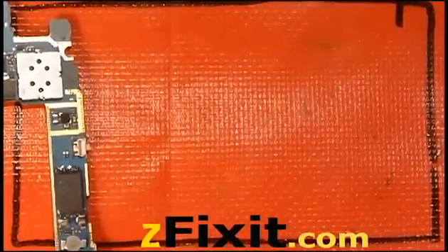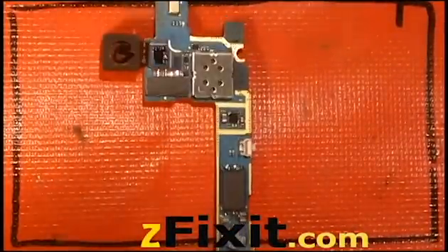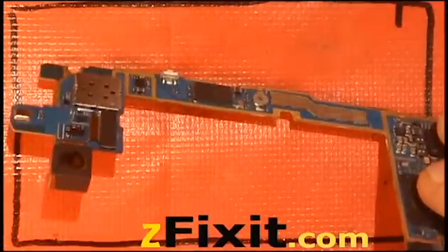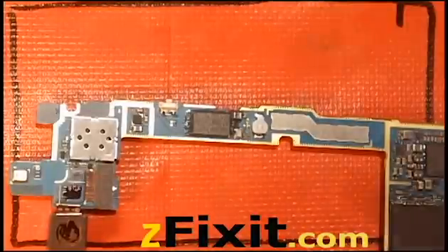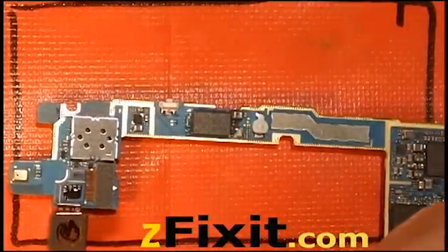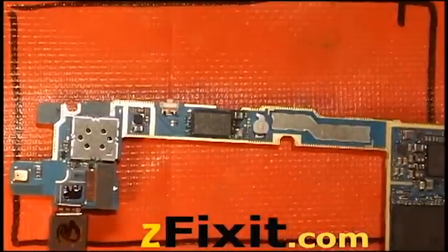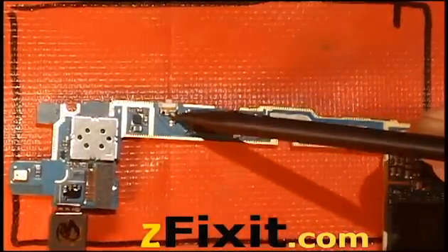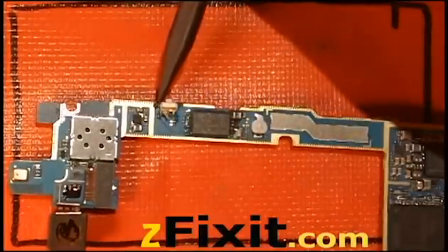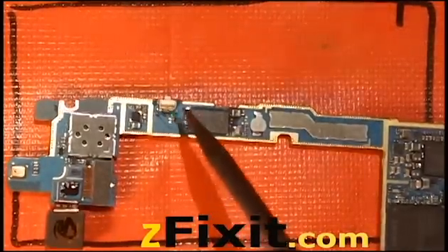You should probably get a little bit flatter, ensuring just a touch of the two top and lowermost contacts. They're both closed. I'm just trying to position the board so the recording will catch everything. The first step is to get some flux. I have a gel type and I just use the spudger to put it on all of the solder points.